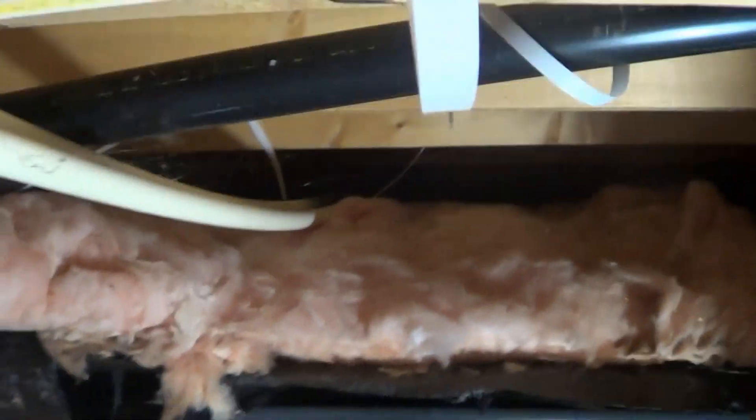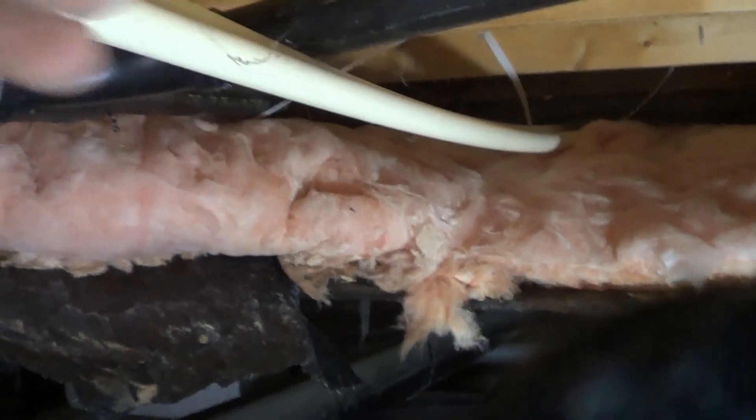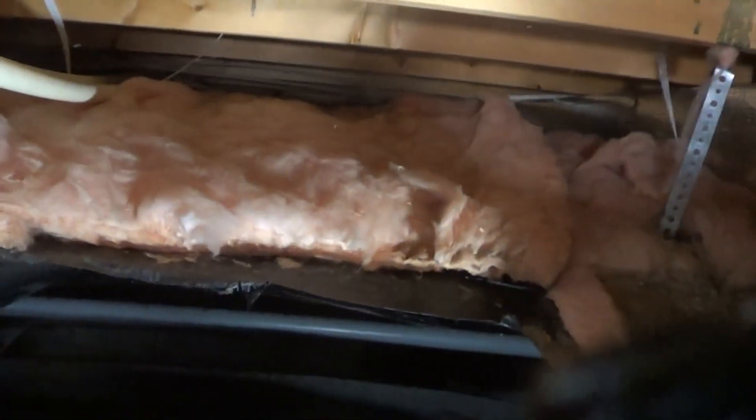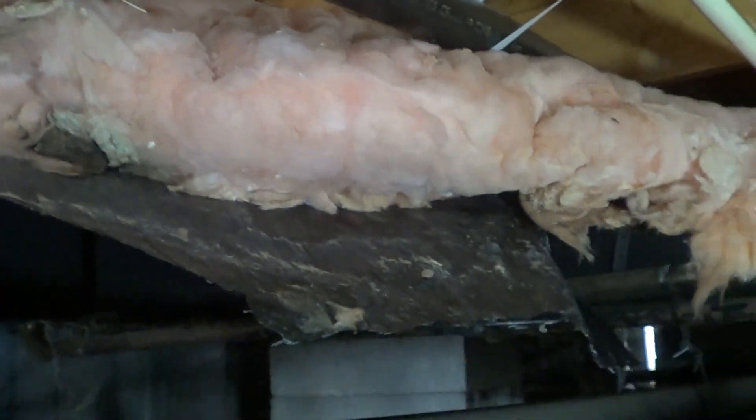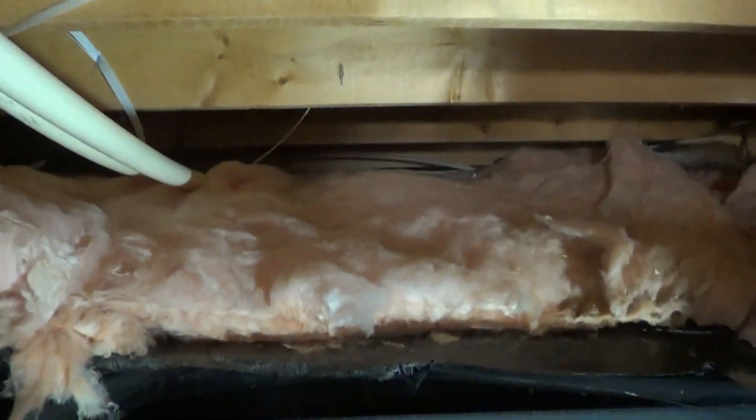You can see that right below the pipes is an insulation barrier, and then they have this little membrane right there. You can see it a little better if we look here — here's the membrane, the insulation, and then the drains. So the drains are supposed to be inside that insulation barrier. Right over from that is the ductwork, which means that warm environment keeps all these things from freezing on cold days.